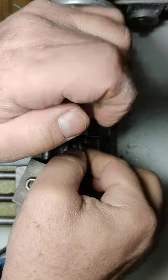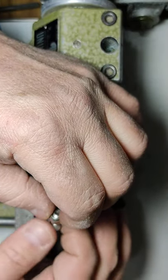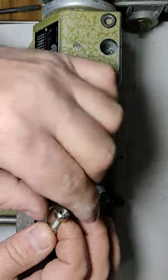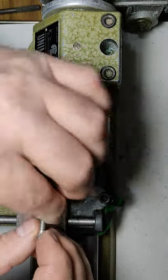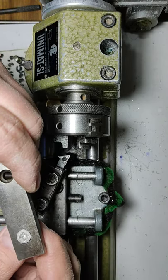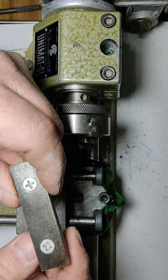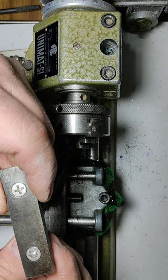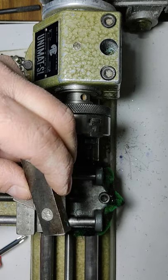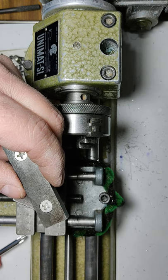One more thing: if you're setting something like this in your chuck, screws and nuts are not perfectly concentric so you'll have to play with the settings — I checked a few and one is dead on. These are basically done, sitting nicely in the hole with some play, which is great. I turned them from 8.7 to 8.3 millimeters, giving 0.1 millimeters of freedom. Thanks for watching — hope it's useful, let me know, bye!